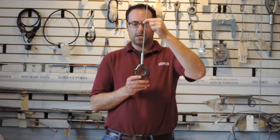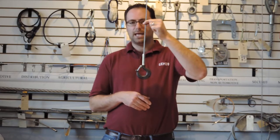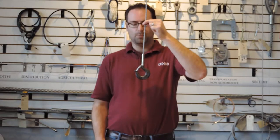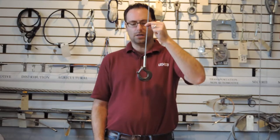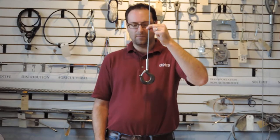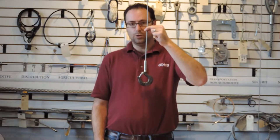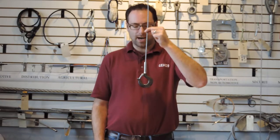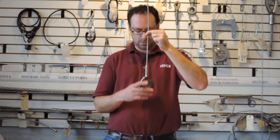What's nice about this assembly is that you don't have a wire rope loop — you have your wire rope terminating right into your hook. So if you have a spatial issue where clearance is a problem and a loop is causing an issue, there is a possible solution with a shank hook.